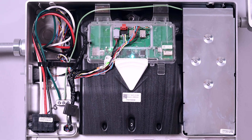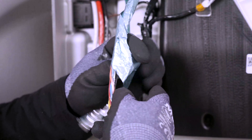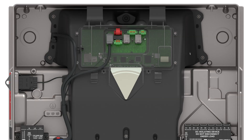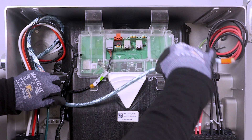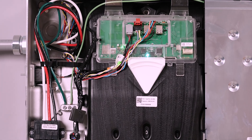With the AC and DC connections completed, the next step is to connect Powerwall 3 to the backup switch or backup gateway. This is done with a four-conductor shielded communication cable with one twisted pair. Tesla recommends routing the communication wiring through the left side of the enclosure using the wire management tabs to ensure wires do not block the Tesla Asset Controller. Do not route loose wires through the front of the enclosure. Strip the communication wire jacket so that it does not extend past the fan conduit, ensuring the individual conductors lie flat and leaving room for the front cover to be installed.